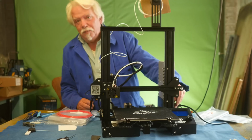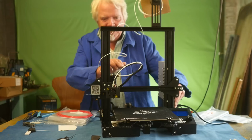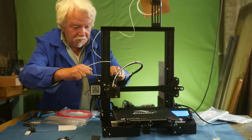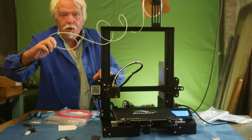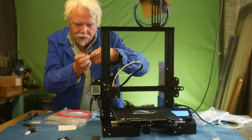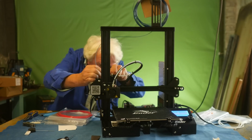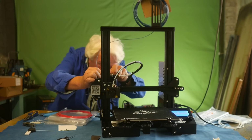So we need to get the old filament out. Apparently the way to do that is to preheat the machine, and it'll soften the filament that's in the tube, and you can pull it out. Okay, so just squeeze the grippy things together and pull. Done. Get my new filament in, so don't forget the 45-degree cut on the end, and in it goes. Hey, I'm an expert now. So you can see the old whitish filament coming out, and now the stuff coming out is blue. Yes!